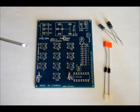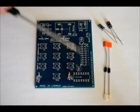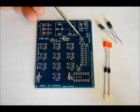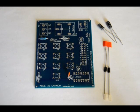For the two 10 microfarad capacitors, they go into the slots for C1 and C3, both labeled 10U. When you look at the electrolytic capacitors, you'll notice there's a long leg and a short leg. The short leg is the negative, the long leg is the positive. On the footprint, there is a plus sign indicating the positive side. Place the longer lead into the hole closest to the plus symbol, and place the shorter lead into the opposite hole. Once you've soldered those into place, we'll place our buttons.